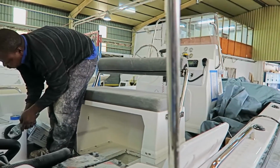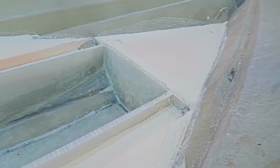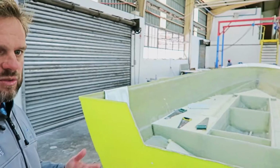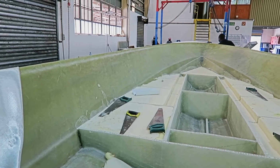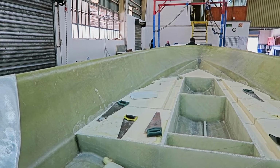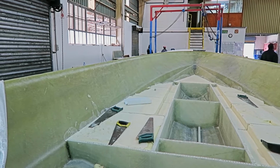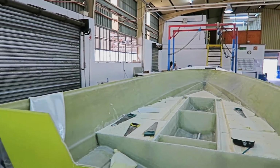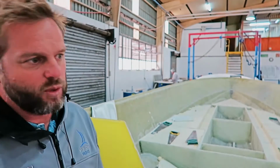You know, my background is yacht building and building big custom boats. We've taken some of that technology and put it into the power boats. There's no wood in the boats. It's all honeycomb composites. It's all composite transom, so we don't have rot issues, but this also gives weight saving. The foam we use on the boats is a high quality closed cell foam. This gives the boat good sound deadening, good rigidity and stiffness longitudinally. Also gives you immense buoyancy, you know, 153% buoyancy in the boat, so you don't have issues with boats sinking that easily, and buoyancy certificates.